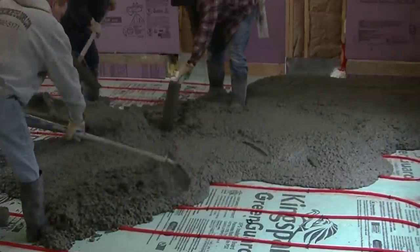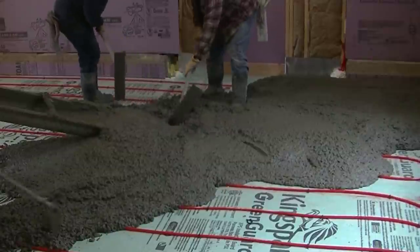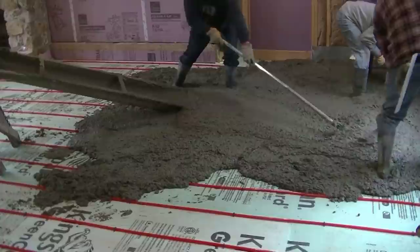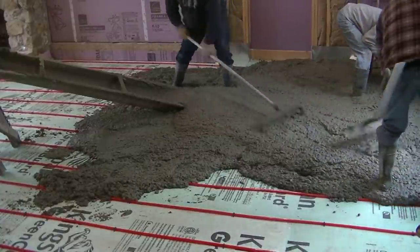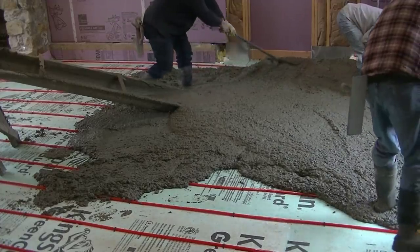In this instance he had plenty of room to add a four-inch concrete floor, which is what we're doing here. We could have gone three inches or six inches — it really all depends on what room you have. We went four inches because that's the height he wanted to come out with, and it worked out really good for this floor. Now we're getting the concrete spread around.